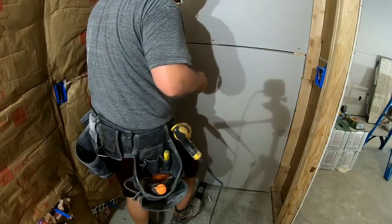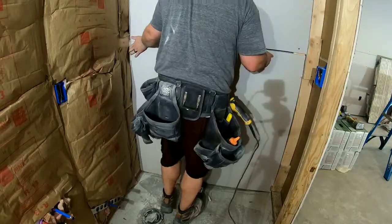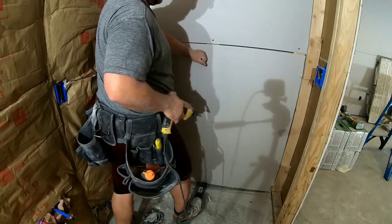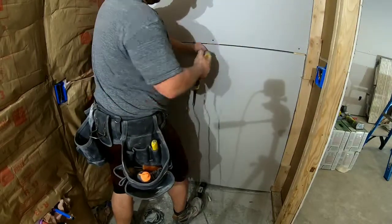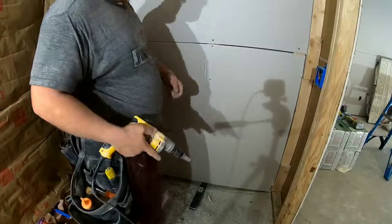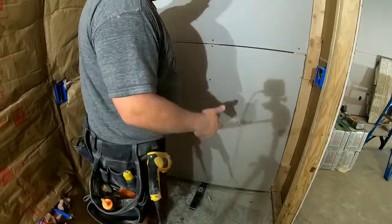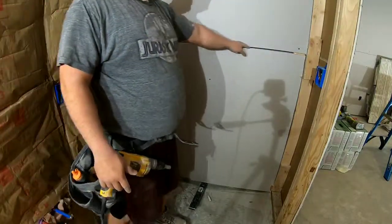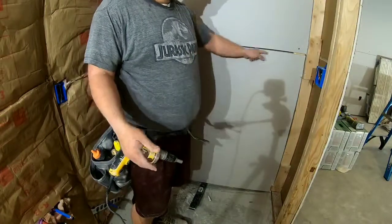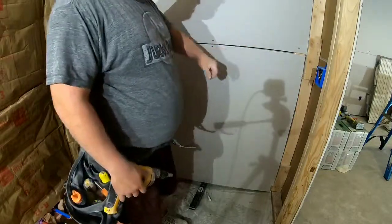This framing is really poor on this job — nothing is square on it. This whole wall is jacked up and I didn't do it. So use your toe jack, lift it off the ground, get it tight. I could take it down and re-cut the drywall, but I can just pre-fill that gap. Pre-fill is going to solve that and you'll never know — it will never crack.